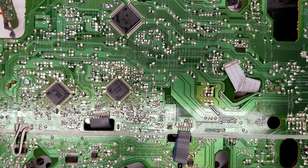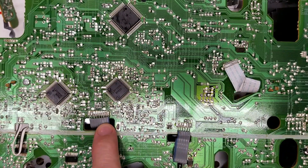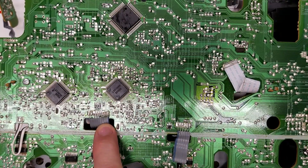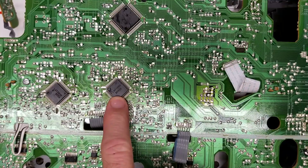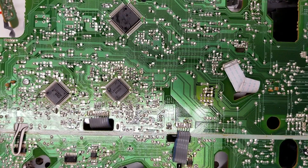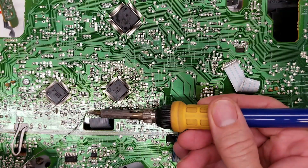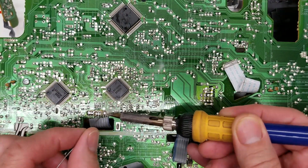I've got it upside down. I'm on the ground of the power supply — this is where the capstan motor gets its voltage, 18 volts. I did not see it waver, but it didn't start to run at all. So next I'm going to have to unsolder all these connections and pull the mechanism out. I've got the board upside down — I'll unsolder the capstan/cylinder motor connector. This connector goes to the ACE head — audio, control, erase. This connector goes to the cylinder transformer, the rotating transformer from the cylinder heads, the video heads.